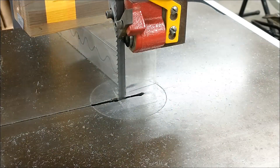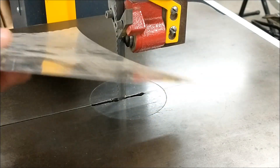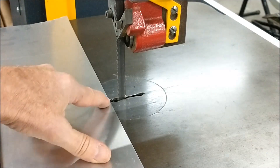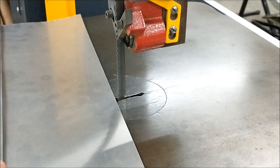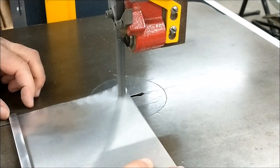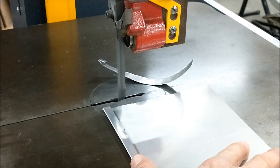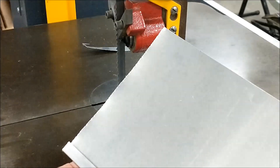Next piece of material to get cut is an extremely thin piece of aluminum flashing. This used to be one of those roll-it-up-into-a-circle dryer vents, which makes for great shim stock — if you can't find it at the home center, go grab a piece of that. I'm going to violate my own rule of thumb by putting a piece of material across this that fits in between the teeth. I do not want to strip the teeth off, and if this was a piece of steel, that's exactly what could happen. I expect this blade to bend it, twist it, just make an absolutely horrible cut. And that is my expectation. Okay — not disappointed. That edge is pretty nasty, with a lot of burrs on the backside, and you saw it jumping around.